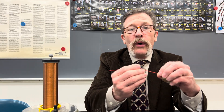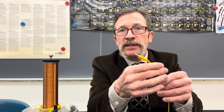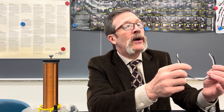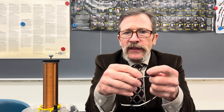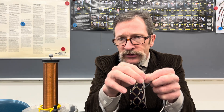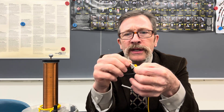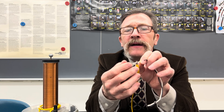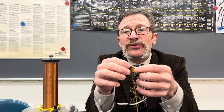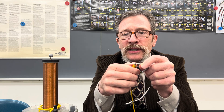I can look at wire — let's use a basic alligator clip with wire in between. There's heavy plastic with metal inside, which we can see on these wires. The heavy plastic protects the aluminum or copper on the inside, and as long as we don't damage the insulation on the outside, nothing is going to leak out — in this case, electrons. Students like to clip alligator clips onto the insulation, but the ends are sharp and can destroy the integrity of that insulation, so don't ever do that.